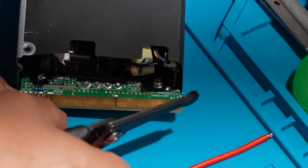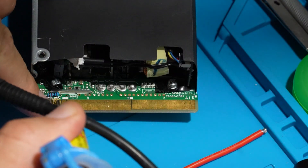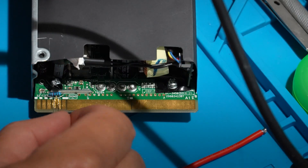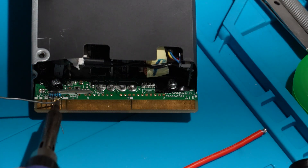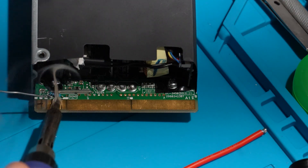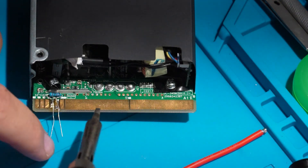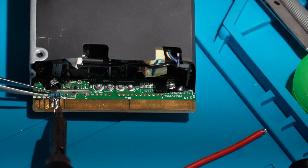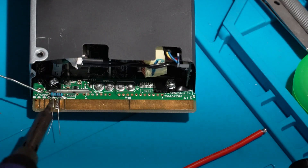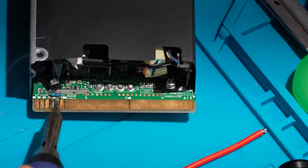Server PSUs like the HP models are hot-swappable, so they won't power on by default. I enable mine with a 20k ohm resistor on the sense pins and a jumper on the control line. Once plugged in, the fan spins, and sometimes it keeps running even after you unplug — that's intentional. It cools hot parts and bleeds off stored energy safely.